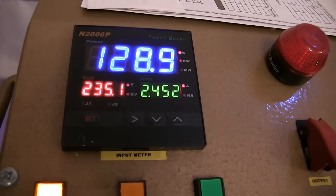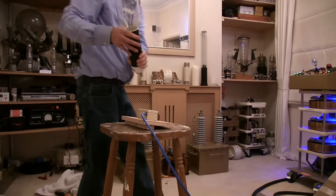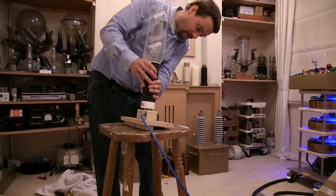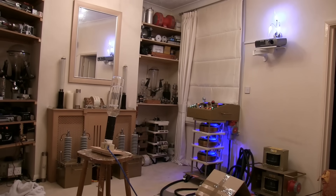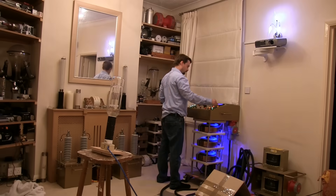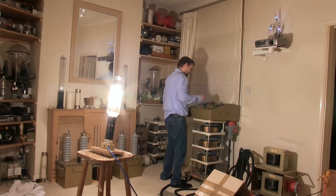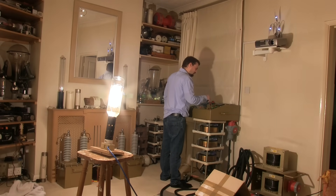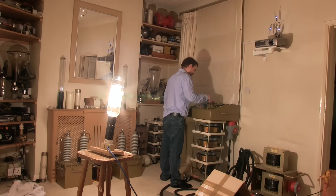I've allowed 95 amps on the input and 90 amps on the output. This first test is going to be on auto exposure, so hopefully the camera iris will just shut down — it may not look that bright but we can certainly see what's going on with the lamp. This will probably destroy the camera! That is pulling 45 amps on the main side, 67 amps on the output. The bulb's voltage has just dropped down to 223... 222.